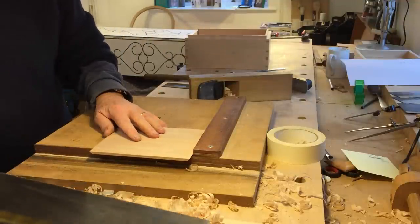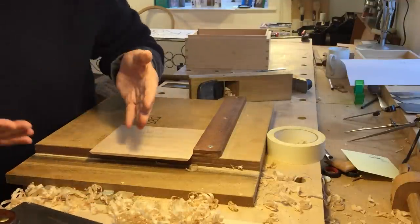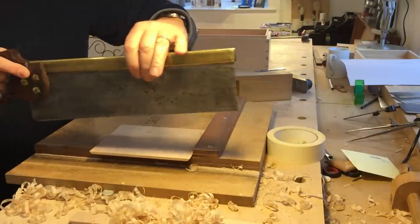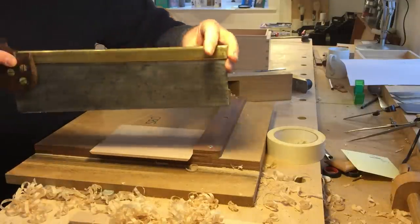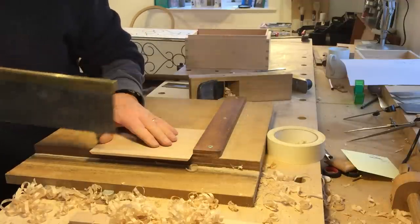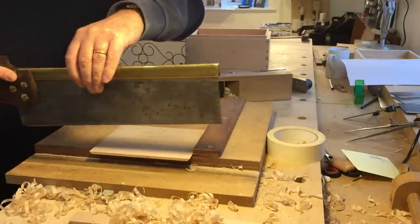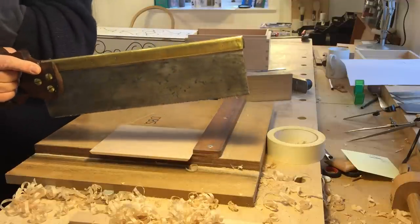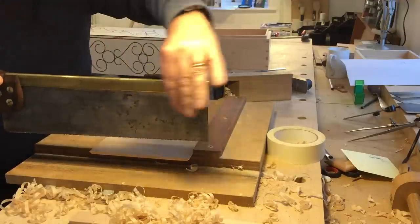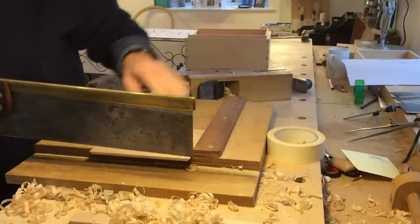The way we do it — your stance is quite important, how you hold a saw. By standing side on, you make way for your arm and the saw. Your arm should be a very straight line from your shoulder down through your elbow, through your hand, through the line of the saw plate.